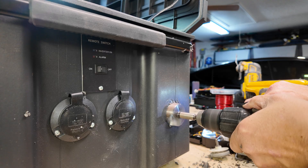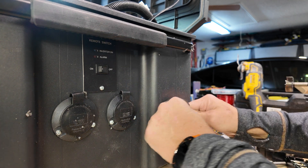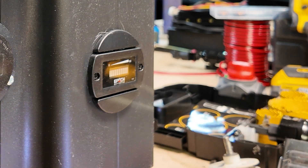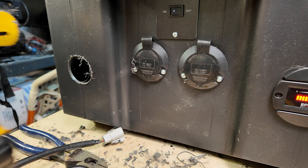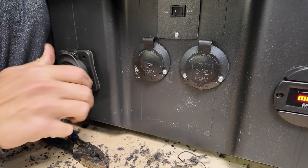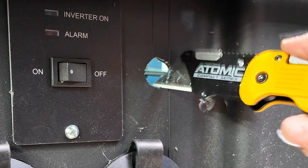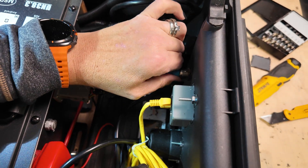I'm going to replace that long ethernet cable with a shorter one later. Next we're going to install the charge meter — it lets you know the state of charge on the battery itself and connects directly to the battery. It comes from Epoch, has a whole bunch of bars, and lets you know whether it's empty or full. On the left side we're going to install the charge port, which has a rubber gasket to prevent water leaking in and four screws and nuts. This port is specific to a specific plug and once used in a 110 outlet it will charge the battery. Last, we have a power switch that's tied into the state of charge meter so you can power the entire system off without having to worry about it.